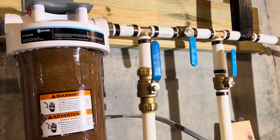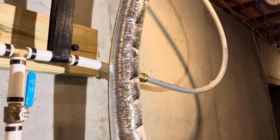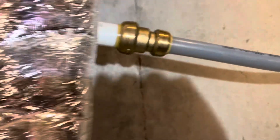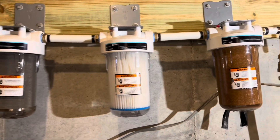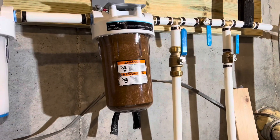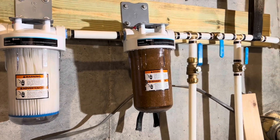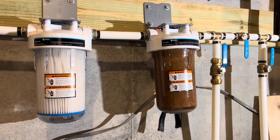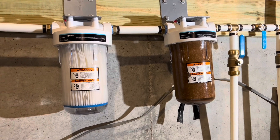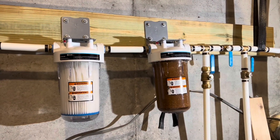After that, we go straight into the house supply, which is one inch for the filter system adapted to three-quarter inch for the rest of the house. Hope that helps anyone thinking about working through this kind of system — it's just one way to do it. Eventually I might add other filtration options, which would be very easy to do since all I'd have to do is tap into the system at whatever stage I want, install one or two tees, maybe a shutoff valve, and I'd have the ability to put in almost any conceivable filter I want, anywhere I want, very quickly. It would be a one-day or one-evening project.